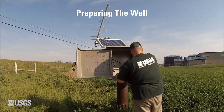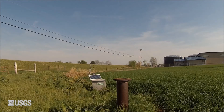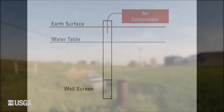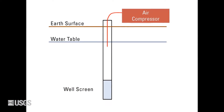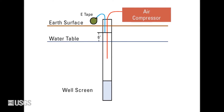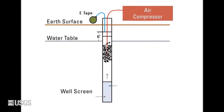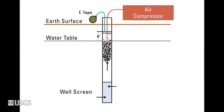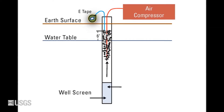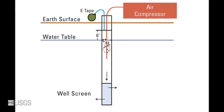Preparing the well. Remove all equipment from the well, including the shelter above the well casing. Place the equipment a safe distance from the well to prevent creating a trip hazard. The water in the well needs to rise and fall several feet to flush the screen. This causes water to rapidly enter the screen during the rise and then during the fall forces the water inside the well out of the screen, removing clogging material and debris from the well and well screen and also cleaning the gravel pack surrounding the screen.